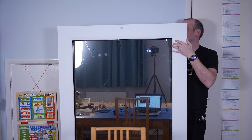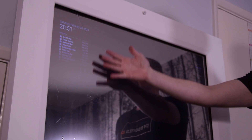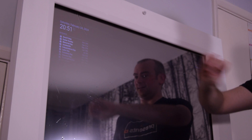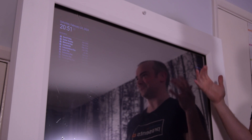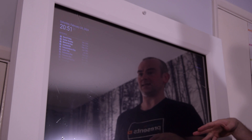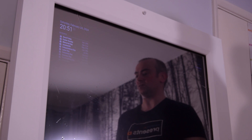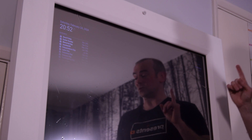Filming a mirror was a terrible idea, but hopefully you can see — it works as a mirror. Up in the top corner we've got a calendar showing US national holidays — I'll change that to my family's ICS from Google Calendar to help us keep track of everything. Up here, a weather forecast — you can set that to your locale but you need to sign up for an API, so I've omitted that from the setup process. The PIR, during operational hours, blanks or unblanks the screen depending on whether there's presence, and I have a cron job which turns the screen off at 11 o'clock at night and back on at 7:30 in the morning — a sensible low-power configuration with a very quick response.